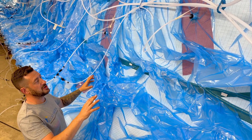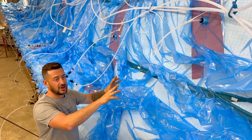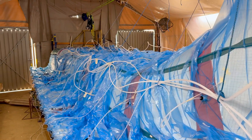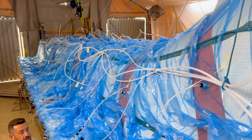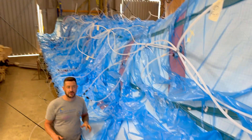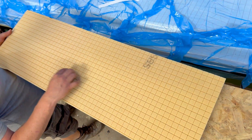With high buildup areas, it takes a lot of time and resin to infuse them, so we need to get the resin there as quickly as possible to give it as much time as possible to wet through the thickness of the material — some of our core material is 50mm thick. Infusion happens tomorrow. I suspect it's going to take around three hours. I'm going to try and slow it down as much as I can because you don't want to infuse too quickly. All of our core will have these resin travel lines in, which helps the resin spread across the job.